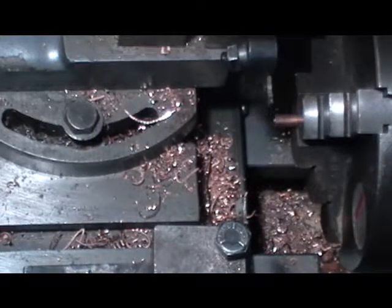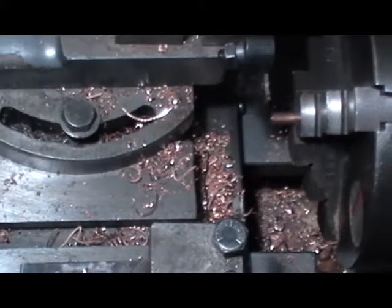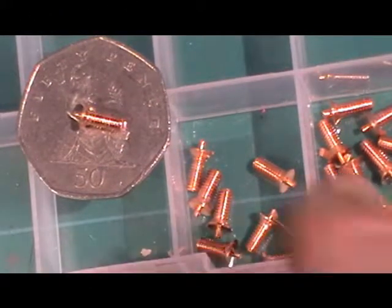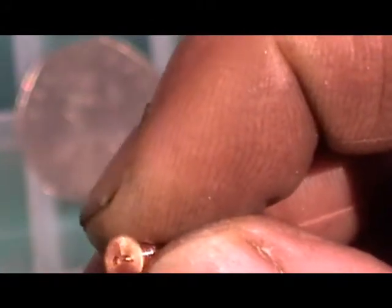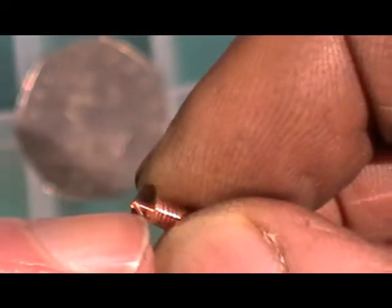Just another 12 to make, I think. So I've got all my screws made now. I've just got to face them off — the parting off tool left a little fraction on — then put a very minute junior hacksaw blade cut just to get my screwdriver in, and then they're ready for use.